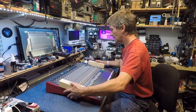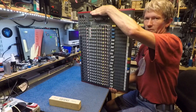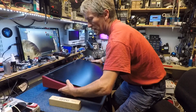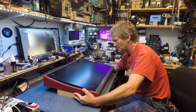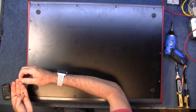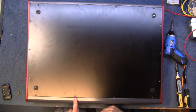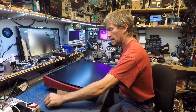So don't nudge any of the buttons, don't move any faders — it's a bit of a tall order. If I use a couple of blocks of wood and don't wobble it around too much, that should keep the buttons off the desk. Some of these screws I've completely had it with, but I've marked with a pencil all the way around the different screws so they go back in the same holes. Little S for the star drives, little X's for the posi drives, and one marked FF because it was destroyed and hard to take out.